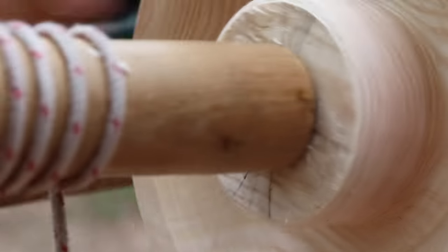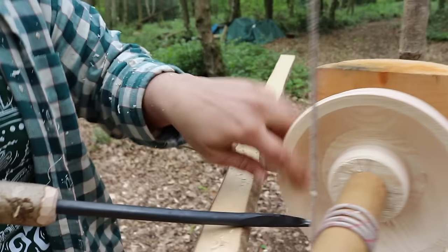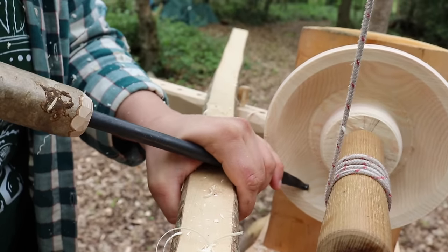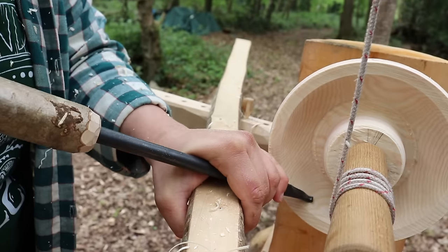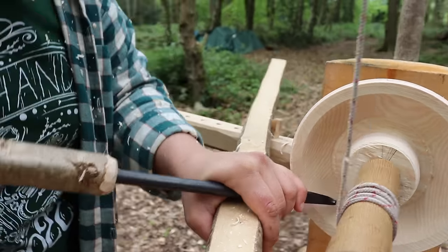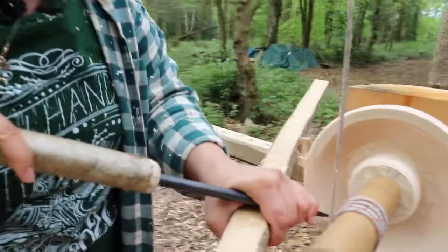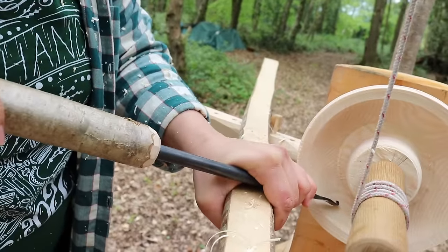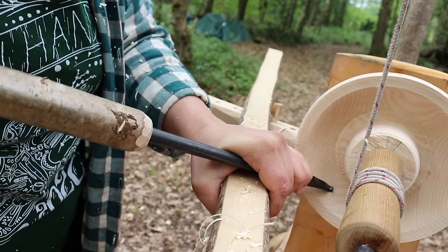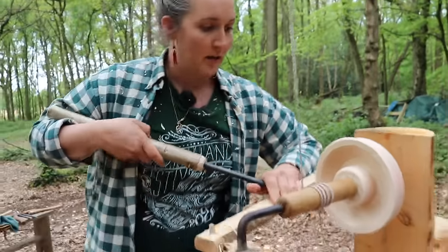So if you've ever done any spoon carving, the application of the tool, the way that it's sitting, would be similar to this being the bowl of a spoon. You're scooping through the wood like this. The back of your hook knife is almost flush with the spoon and then just slightly engaged. You wouldn't take the hook knife in the bowl of the spoon and go like this. It wouldn't have a nice finish. So again, that's the scraping cut when it's at a right angle to it. And then when it's almost flush with the material and you go shoo, that's the movement without a spinning piece.